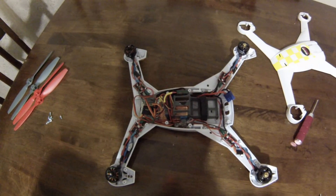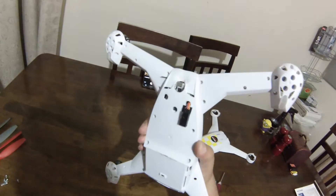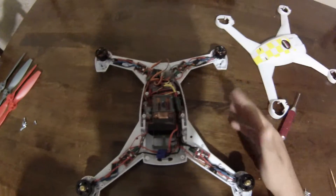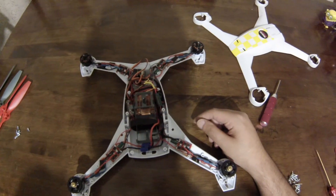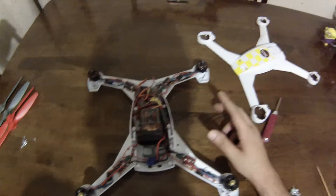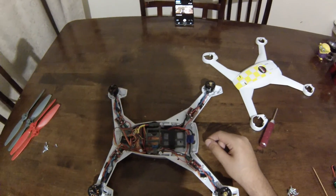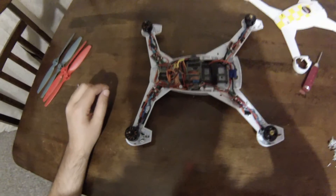Pretty much that's it for this build — nothing much more to do beyond what I explained. For acrobatic flying I ditched the compass, the GPS, and even the landing gear — didn't really need them. She just flies beautifully in Horizon mode. In the future I might stick a camera and a transmitter in here and try to use her as an FPV trainer or racer — though she's a bit big to race. There's already a video on the channel of this flying line of sight if you're interested. Thanks and see you in the next video.